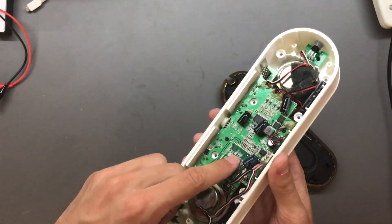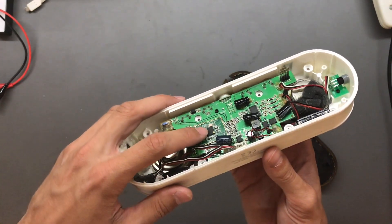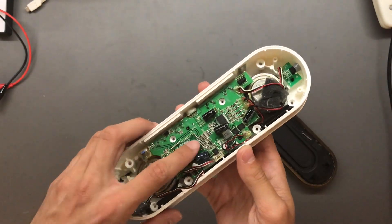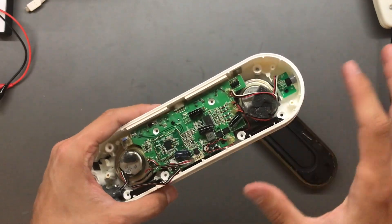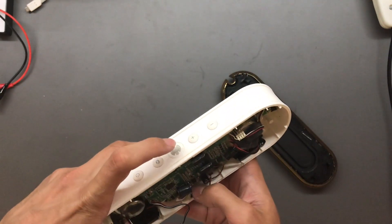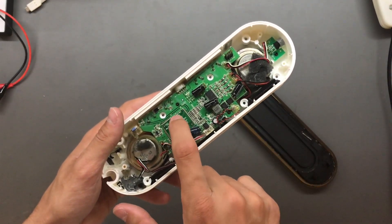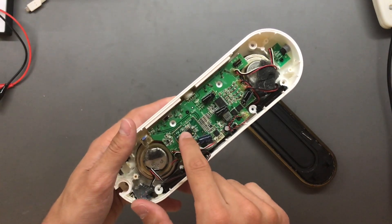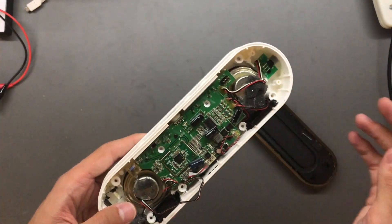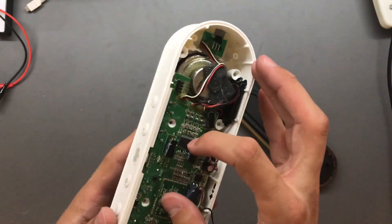In this case it charges at one amp and it definitely doesn't dissipate the entire amp linearly — it only gets lukewarm, so you can tell it's doing something but it's not running hot. It's impressive that they're leveraging the Bluetooth chip rather than adding an extra part — they're controlling the top blue LED with it and there are some dimming functions, which actually leads me to think it might be something more capable than the 8645.